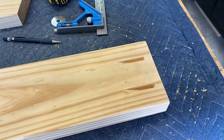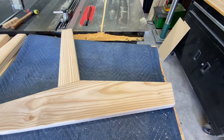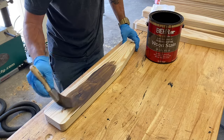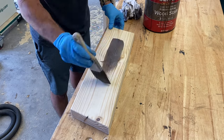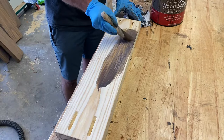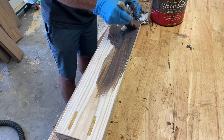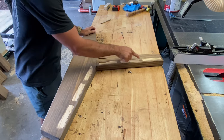Here's the legs. Here's the seating slats. And here's the base. Now let's do a little pre-staining. If you're not used to this, get used to it — this makes the process simple. If you want to build a project and then flip things upside down and crawl into crevices staining, by all means go for it. But I love pre-staining. Just be sure to leave spots out that you're going to glue later.